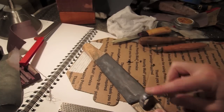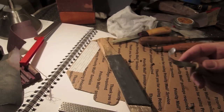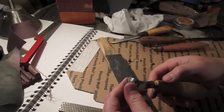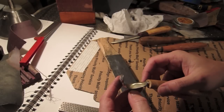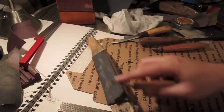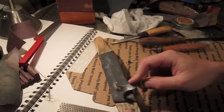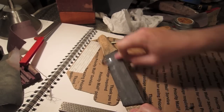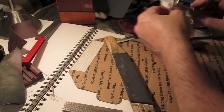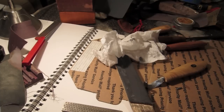If you don't have extra leather, the super secret tip of the day is that the inside of a cereal box is one of the best strops available. You can also use the inside of a soda or beer 12-pack box — that cardboard is the same. Regular box cardboard has a slightly smoother finished surface and a firm backing, so it won't be too soft and won't round over your nose like a soft backing would. You can lay it down, put stropping compound on it, and finish on a bare part for a really nice edge. It's disposable and you can wrap it around anything to make a contoured strop.